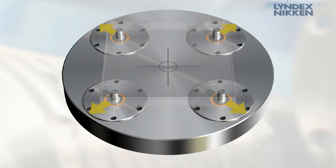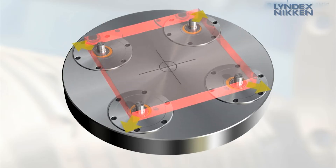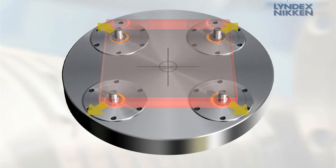This will not happen with a zero clamp system. The clamping cones integrated and vulcanized in the chucks are provided with radial springs, thus compensating any thermal dilation of the pallet. Even in the case of highest thermal variations, the pallet zero point will always remain within the center of the turning axis, an essential quality requirement not only for machining on rotary tables.